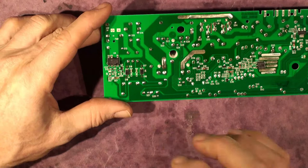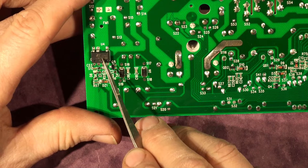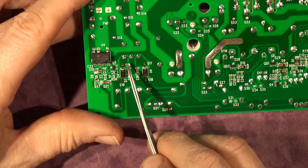I've used this chip before. There's a chip on the back here — it's an LNK304, and that's an offline buck regulator. So that takes in 300 to 350 volts, anywhere between 90 and 350 volts, and usually switches it very fast through a series inductor to make an offline power supply.